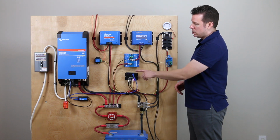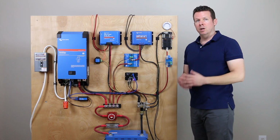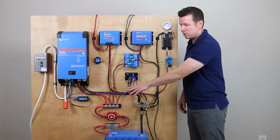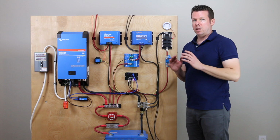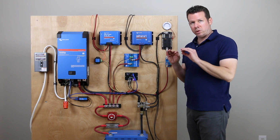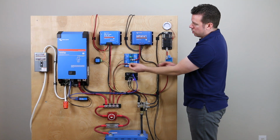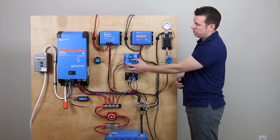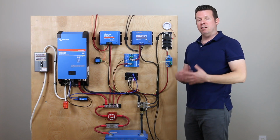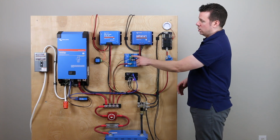And what would happen if the unit wants to shut off those chargers, it would shut both of these off with the charge disconnect line. So right now the charge disconnect line here is split into 2 lines. It comes out as one, goes into a butt splice, splits into 2 lines, and goes here and here. In a charger shutdown scenario where the BMS wants to shut those down, it will drop the voltage from 12 volts in the yellow line down to 0, and that would essentially pull power from this yellow line, and it would break the solar positive line here, the battery positive line coming from solar, and it would prevent any solar power from getting through to the battery if the battery's in an over voltage or over temperature scenario, or for whatever reason just wants to shut down all charging. That's how it would do it.